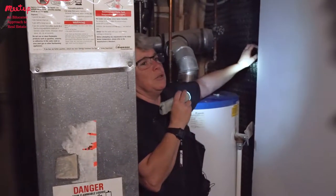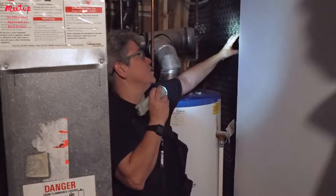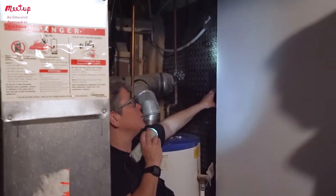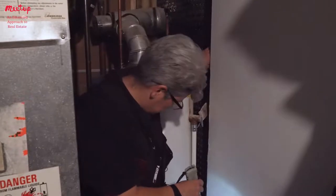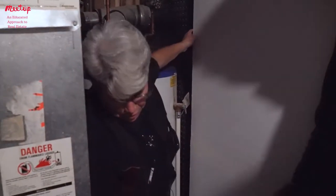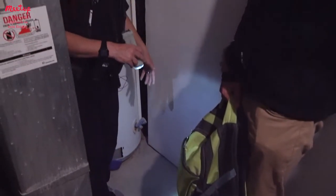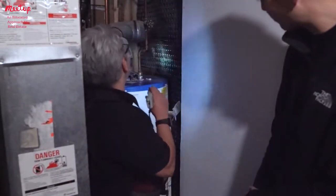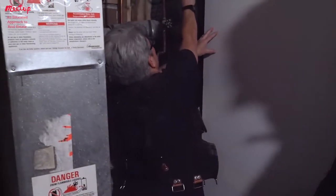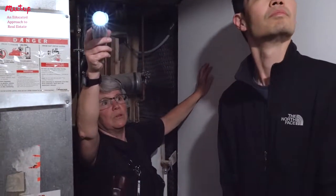Here you see signs of interior waterproofing. In these houses, if you haven't had waterproofing installed on the outside like new houses have, you can put it on the inside of the basement wall — it's this black dimpled material. It goes all the way down to the bottom. You can see it's been cut along the bottom with new concrete down there, indicating they've put waterproofing and drainage into the floor so water coming through the foundation will drain out. Here you see the newer supply piping — the white plastic called PEX — and some copper transitioning to PEX.